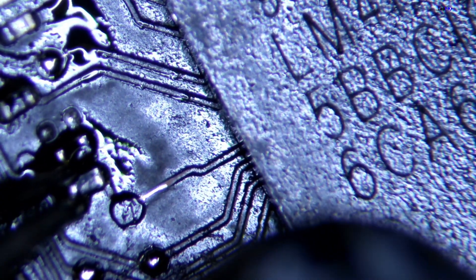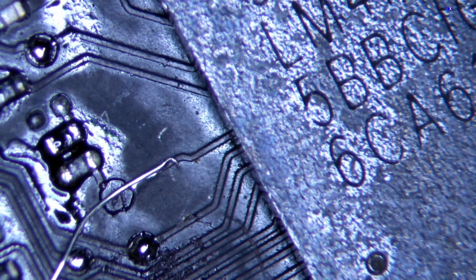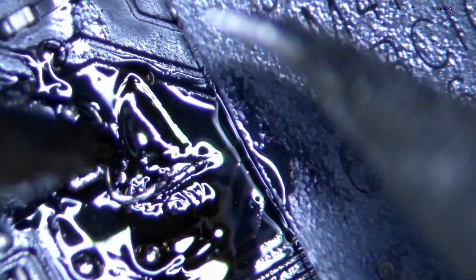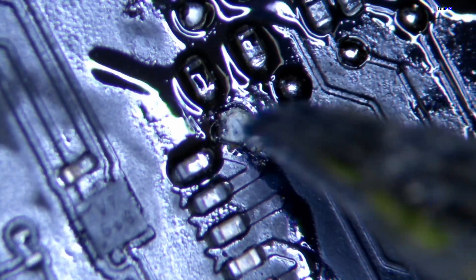We have a brand new resistor but it's still not going to connect well because that probe point is a little bit too damaged. So we need to make a wire going from the part that we dug up to connect from the trace to the resistor. We're going to avoid that bad probe point because it's just too far gone - there's too much damage to it. Making a wire does the same thing anyway - it's just a flow of electricity. It looks to be pretty good.